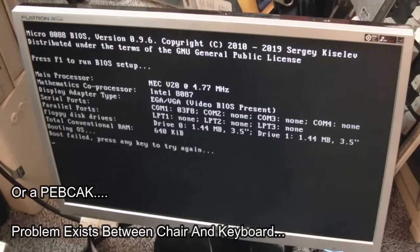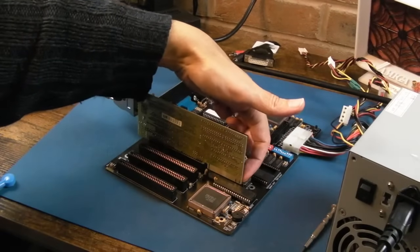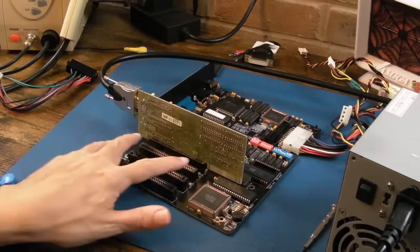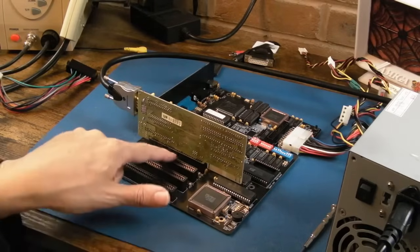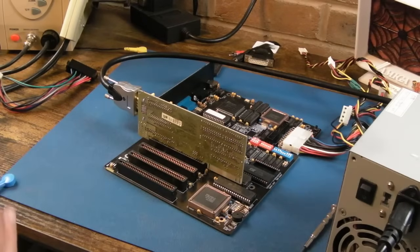Let's switch that off. And you can see how I was testing that, so I was being very careful. This 16-bit part here was not shorting on there, and this is one of these cards that if it's in an 8-bit mode, it'll fall back into 8-bit. But obviously there's limited places you can install it because it'll interfere with things here. But anyway, at least we know that the backbone of this is booting.